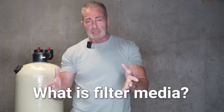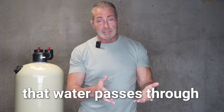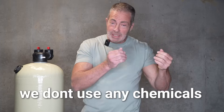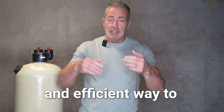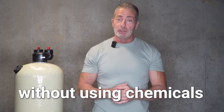The last thing is the type of filter media we use. The filter media is the product that goes inside the tank that the water passes through in order to become neutral. We use Thomasville Calcite, which is a natural limestone product. We don't use any chemicals and we don't recommend chemical injection. We've used it for almost 30 years and it does a better job than crushed marble or any other products offered in the industry today. The acid neutralizer is the most effective and efficient way to raise the pH in your home's water supply without using chemicals.